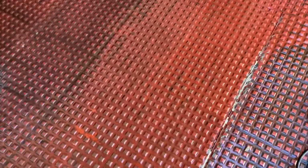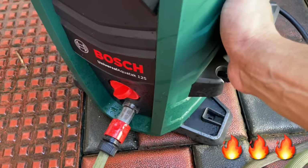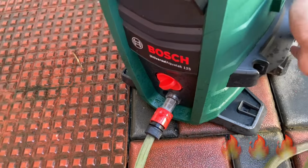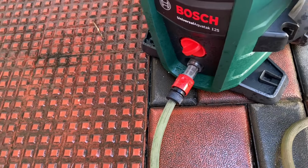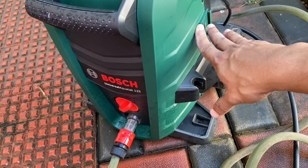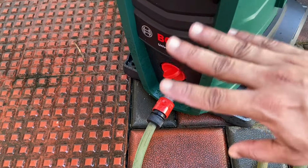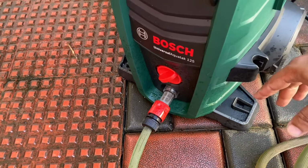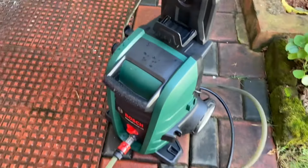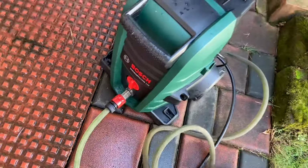The pressure washer is good for cleaning patios as well. Just ensure that you do it in breaks, because this unit gets heated up real bad. Sometimes you'll also get a smell of the motor burning, but trust me, it's fine. The coil doesn't get burnt out so easily. But ensure that you do it in breaks so you don't completely burn out the unit and cause a lot of noise. But once you're done, just turn off the unit and disconnect all the piping connections